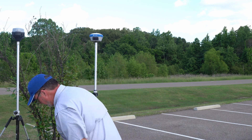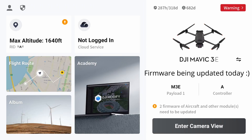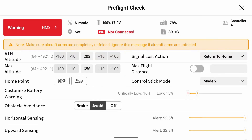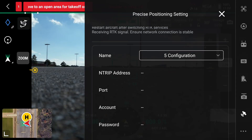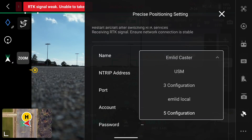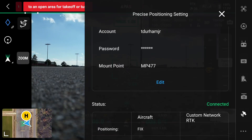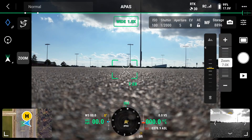Now let's power on the DJI Mavic 3 Enterprise and let it get powered up. Going into the camera view, making sure I have internet — yes, connected to the jetpack. Going to RTK settings: with the Mavic 3E you can have five configurations, just like on the M350. We're going to select the Emlid Caster configuration — that's configuration number one. As soon as I select it, it immediately says 'Converging' and in pretty quick order it goes to a Fix. There we are — it is connected and working.